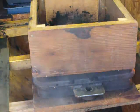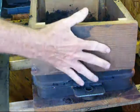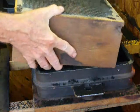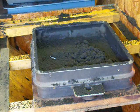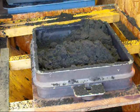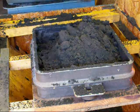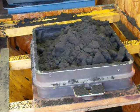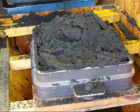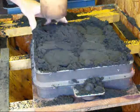And sift a little sand. Now you see, aren't those patterns going to kind of rock around a little bit because of the convexness? Fill this up. Now when you ram this you need to kind of ram it gently initially so you don't move those patterns around.